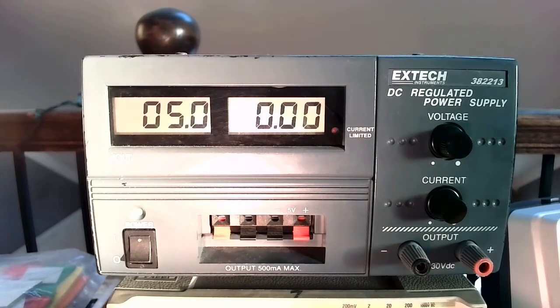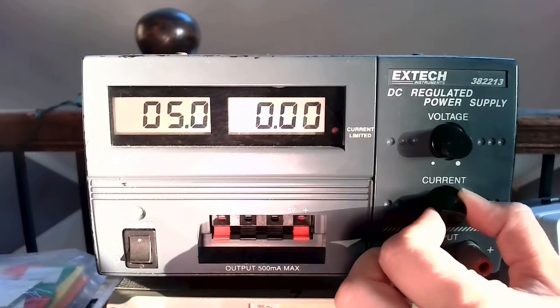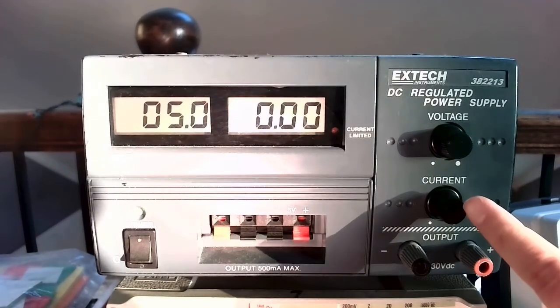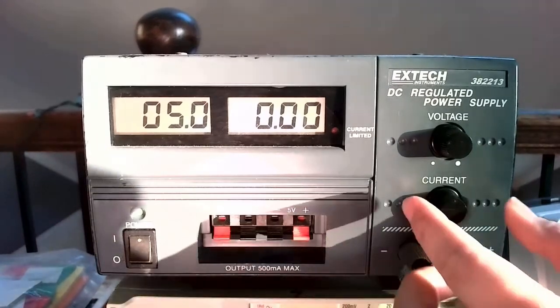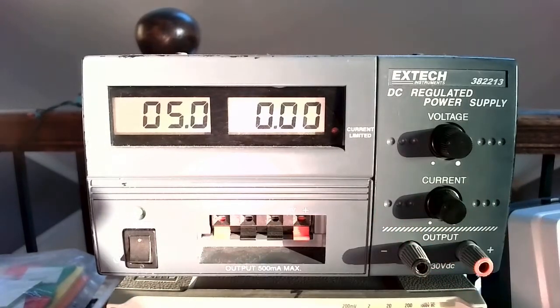In the least protected mode — all the way to the right — this power supply will enable 2 amps to flow through this. We are never going to have 2 amps flowing through our circuits. If 2 amps are flowing, something's going wrong and we're going to make a lot of magic blue smoke come out of our parts. Somewhere in the middle is 1 amp, which is still an awful lot for our circuits. When the dot on the dial is facing directly up, that's 1 amp. I recommend having this dial at around the 10 o'clock position. A few hundred milliamps is all that should be going through this device at any time — that's enough to illuminate several LEDs at once.